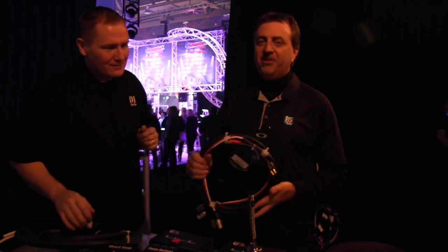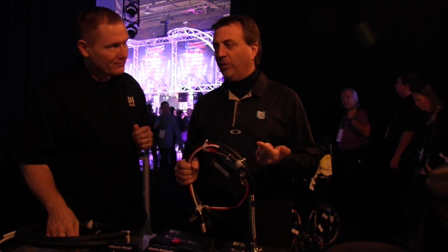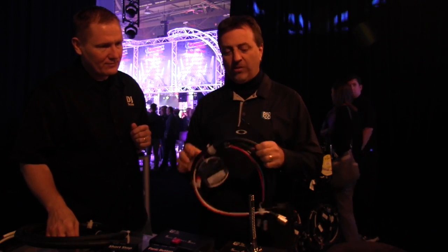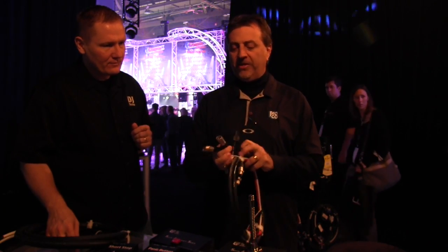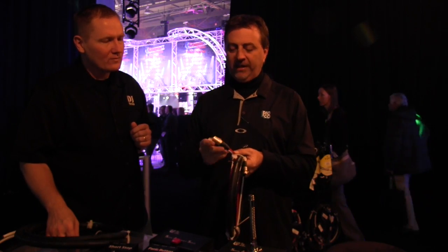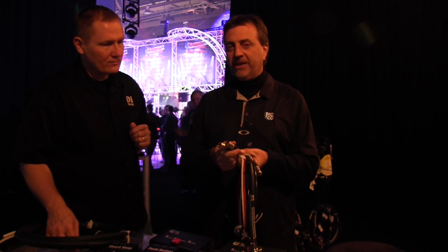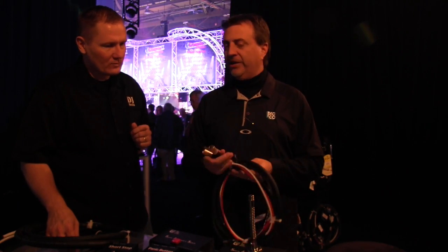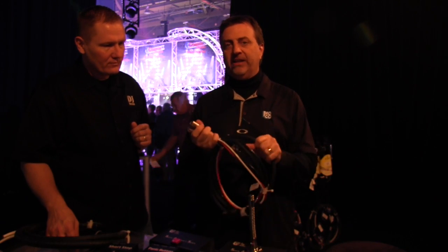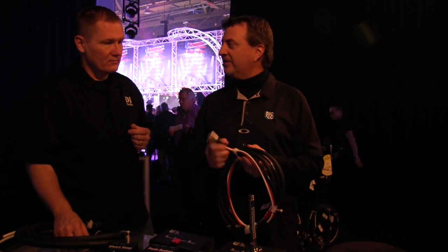It's a very exciting cable right here. It's called our Siamese Twin Cable. It carries power and either digital audio or DMX all in one jacket. What we've done is we've cabled together in one single jacket your power distro and two channels of AES-EBU digital audio. Now that can be used for digital audio or even DMX control, so we can terminate this with DMX connectors. And then you've got your power, your DMX, or your audio traveling all within one single jacket out to your powered speakers, your lighting fixtures, wherever you need to carry that signal.